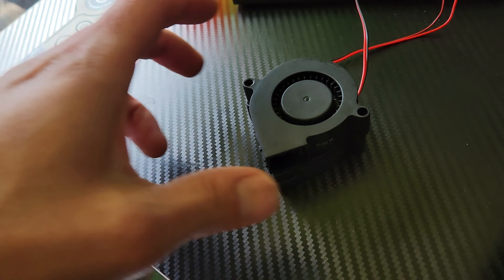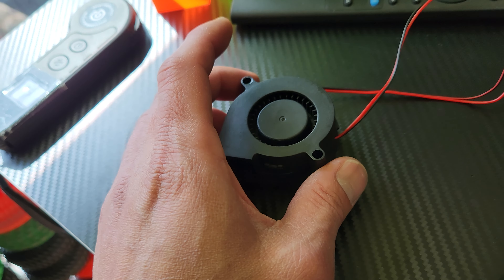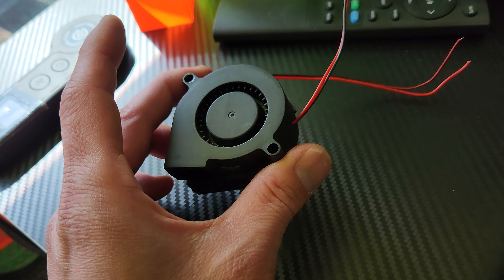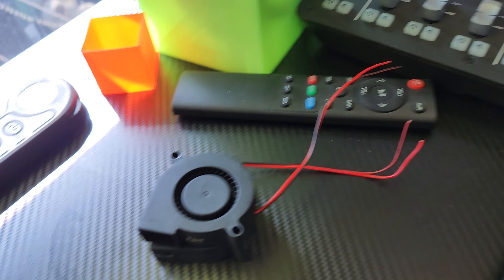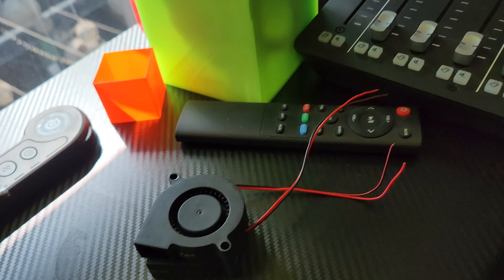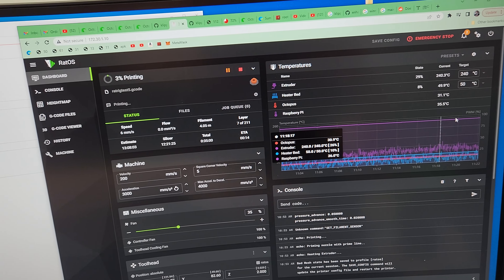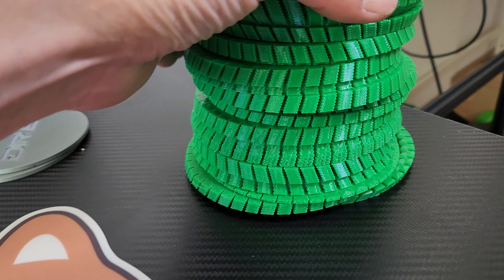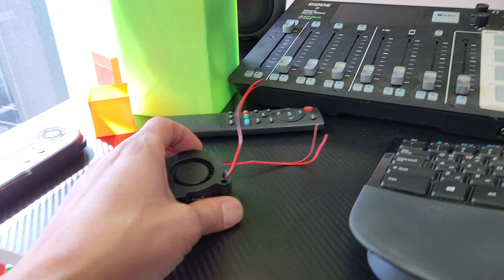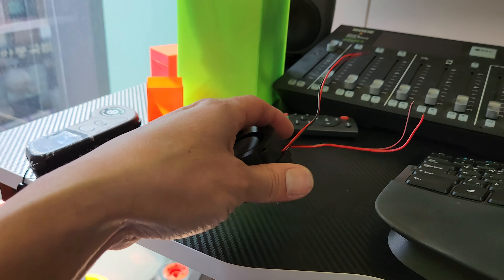So I highly recommend these for non-moving stuff like a Nevermore filter — they're great for that. But if you run them at low speed like 20%, you'll hear this weird electrical noise, and I think that's part of the problem. Don't use these near the hot end or thermistor; they can cause electrical noise problems. All my problems are gone as soon as I swapped out the fans.